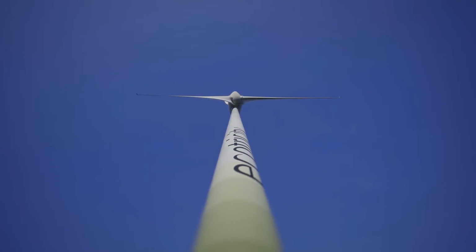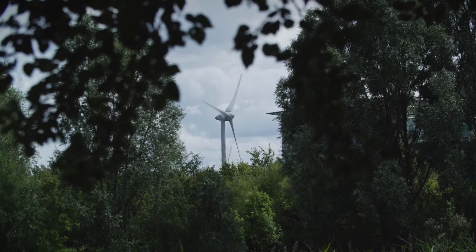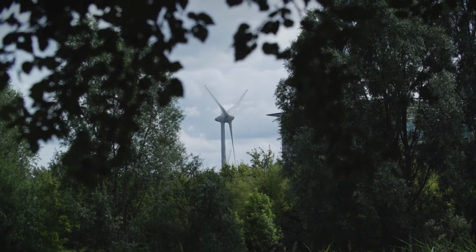The tower itself is 85 metres in height. The egg-shaped thing on top, obviously the three blades come away from that. Those blades are the things that physically catch the wind, and those blades measure 35 metres in length. That means at the turbine's highest height, as the blades go over the top of the hub, it's an absolute maximum of 120 metres tall.